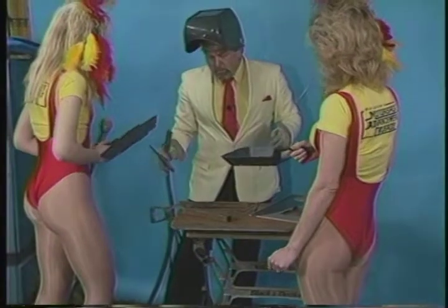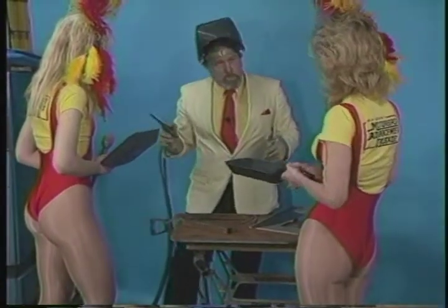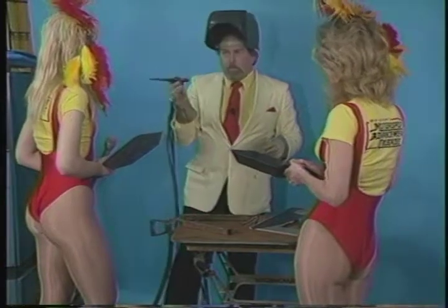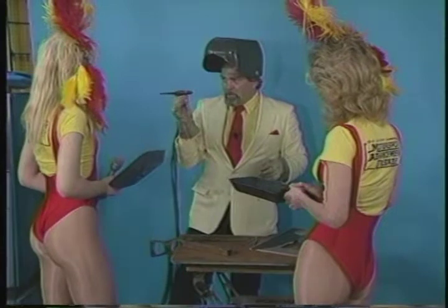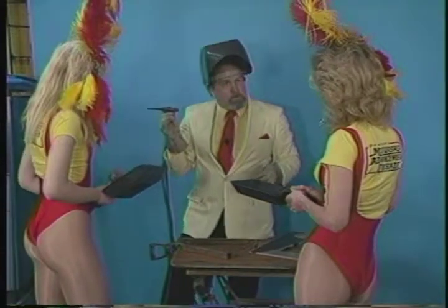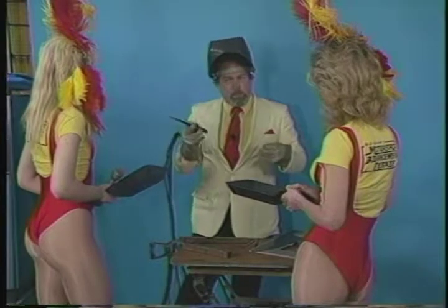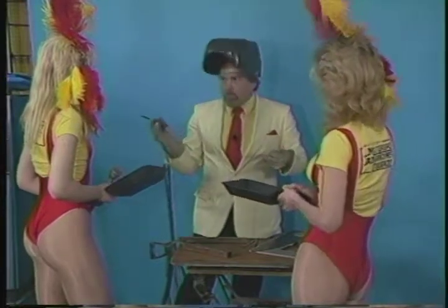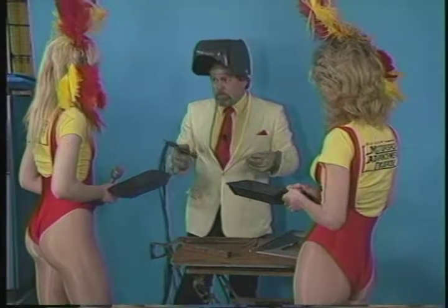What I want you to see is it only happens with the accelerator pedal. That's what does it, as I push down more and more. This is like when I had you doing the oxyacetylene welding. You control the temperature of the flame. The more heat you want, you just step down. If it's too hot, you just back off on the thing. So you can literally establish the puddle nearly instantly and move along with your weld. And when you're welding aluminum, it's real important to have that fine of a control, and we'll get into that.